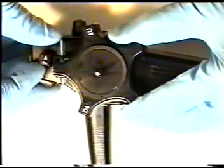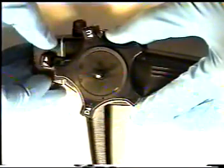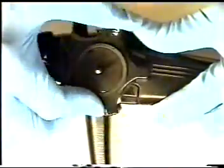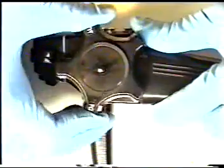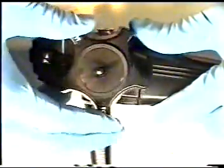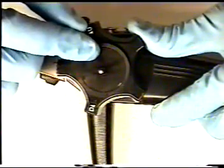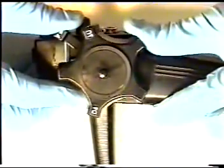Now, apply your lock by flicking your up-down lock assembly towards the head of the instrument. And now you can feel to check for the tightness that you have released by adjusting the cam on the up-down block assembly. If it is still too tight, you can remove the ring again and adjust the cams clockwise or anti-clockwise to get the proper tightness that you prefer.